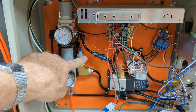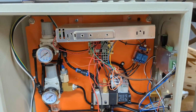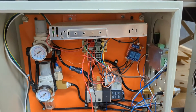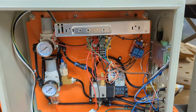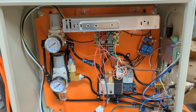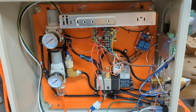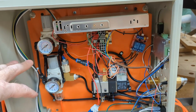You see here there's an air sensor, so that if your air pressure isn't good, the software, they actually built it into the screen, detects whether or not there's adequate air pressure in the system. So you'll get an error, and it'll not run if you don't have good enough air pressure. Obviously, if it doesn't deploy properly, you won't get a good focal point if it's not all the way down, and you also won't get good air at your nozzle. So that's a nice safety thing.